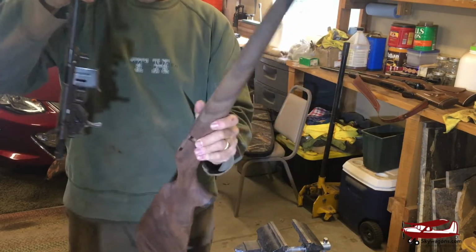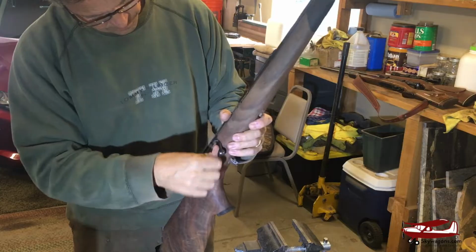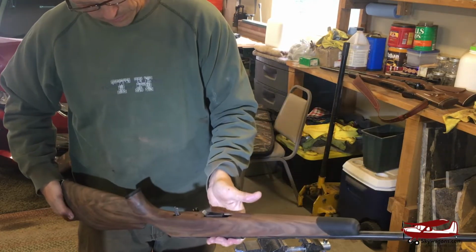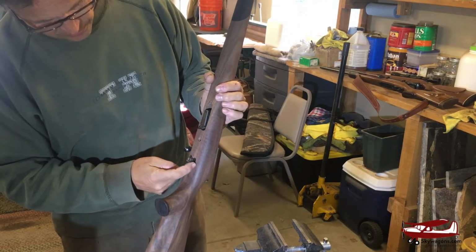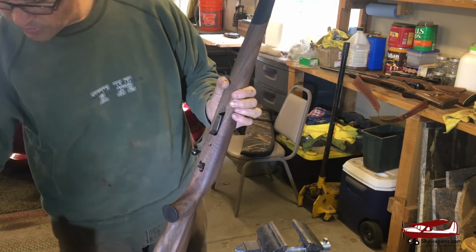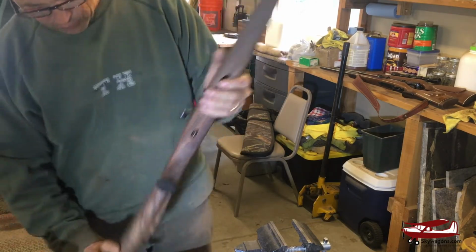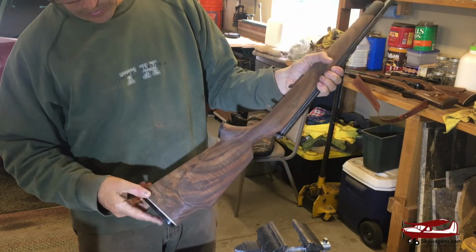This is a little 22 mag. It'll look right. Trigger guard and everything's over there. The original gun, everything is on the surface. I've countersunk it. I'm going to countersink the trigger guard, I'm going to countersink this magazine bracket that's over there, so that it's below the surface. On the original stock, it all just sticks out. So I'm doing a few upgrades with it. I've also raised the cheek piece on it because I'm going to have a scope on it. That stock was a bit too low for a scope. So I think it looks nice too.